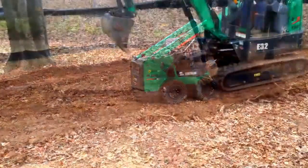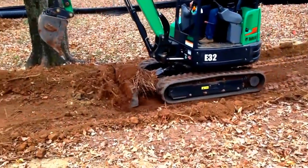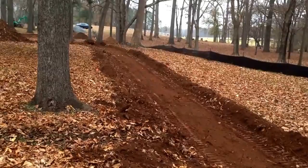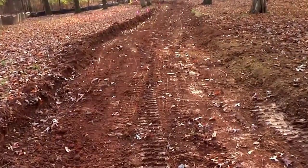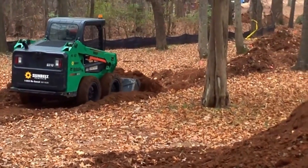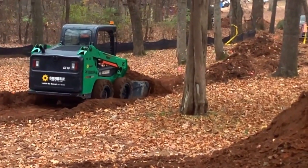Remove topsoil, harmful debris, and unsuitable material from the site. Make sure to cut any stumps and projecting vegetation as close and even to the ground surface as possible. Depressions or bulges greater than six inches or 15 centimeters should be leveled out.